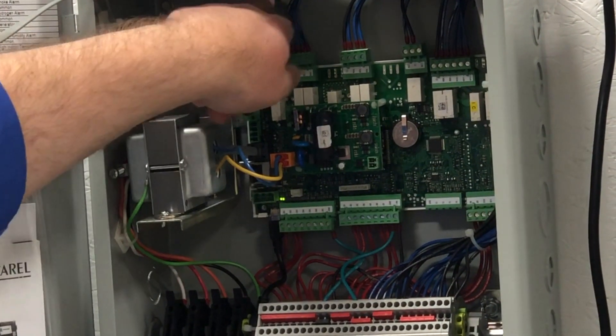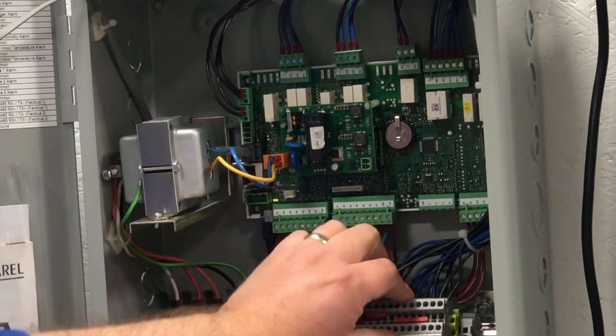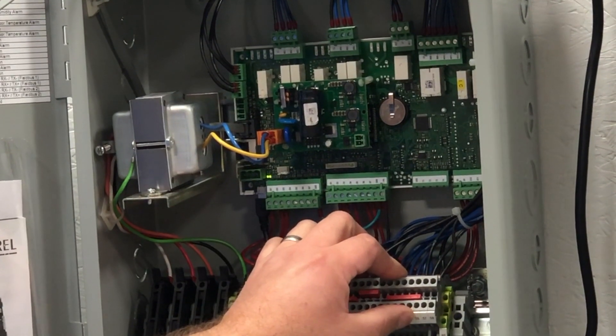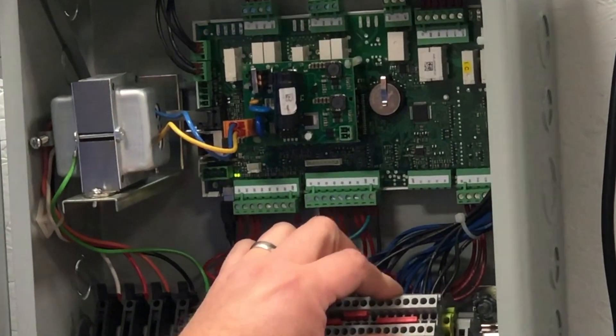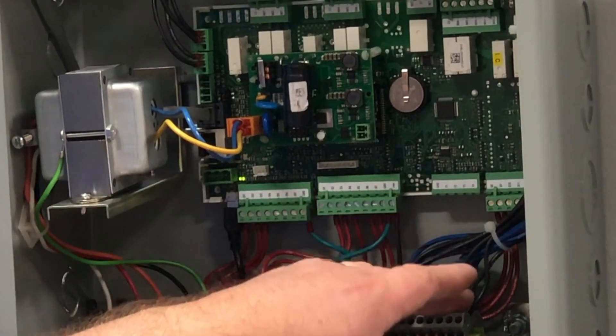If it is tight, we want to verify that the two wires here are wired correctly to this terminal block. You can check that in the installation instructions — there's a wiring diagram, and also in the instructions for the unit and supervisory controller together there's a package there. So once we've checked and verified that the wiring is correct, we move on.